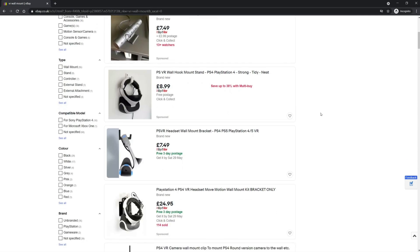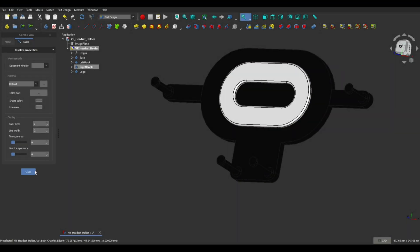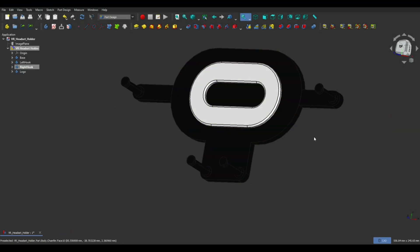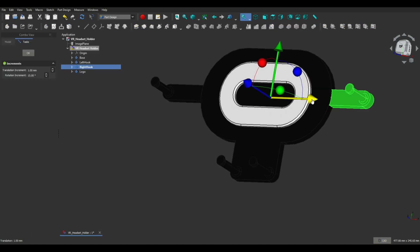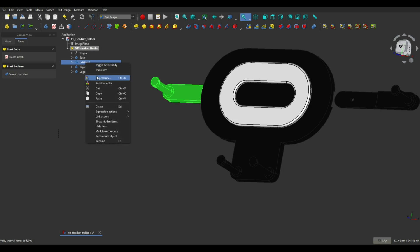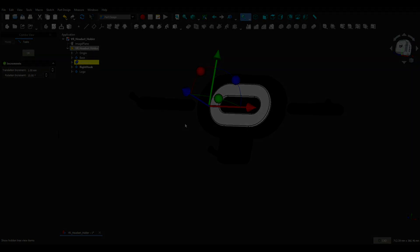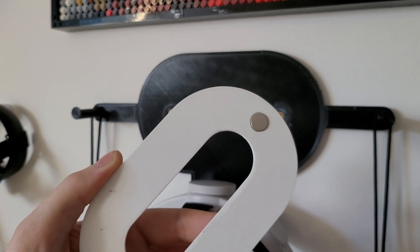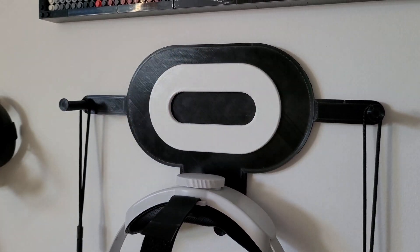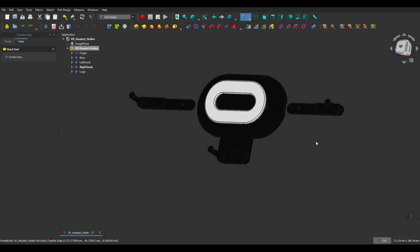I wanted something that would look good, work well, and fit within my office aesthetic. Working over a few sessions with Sam, we designed a wall mount that was functional, looked good, and was also compatible with all my headsets and the third-party head straps that I use. There were a few challenges to overcome, such as the bed size on the Ender 3, wanting to have multiple colours in the design, and how to hide the screws. We ended up having the arms print separate to the body, used the screws to go through holes in the body and arms to hold them in place, and then we actually used magnets in the Oculus logo to attach it to the base — which had the benefit of not only hiding the screws, but also making the logo a separate print, meaning no changing filament mid-print to get the logo a different colour.